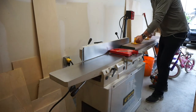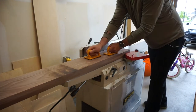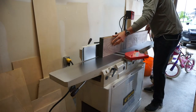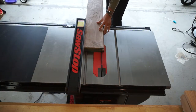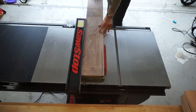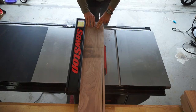After I had fabricated all of the steel parts for the base I moved on to the walnut pieces that would extend down to the floor. I took a piece of one and a half inch thick walnut to the jointer to get one flat face and one flat adjacent edge. Then using my brand new SawStop table saw — not sponsored — I ripped two three inch pieces which would give me the four legs. Once they were cut I ran them through the thickness planer down to one and a half inches thick.